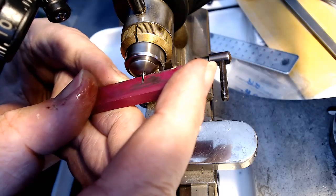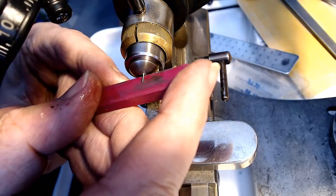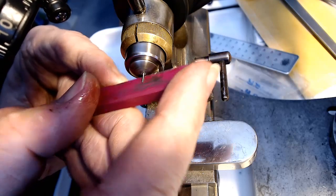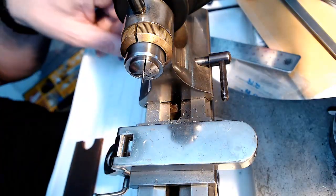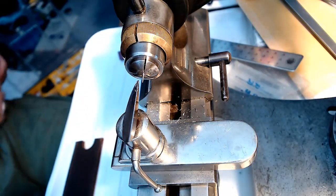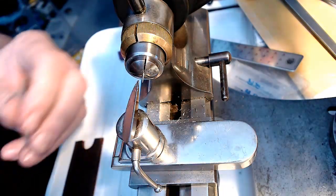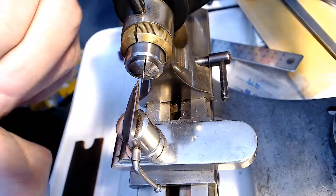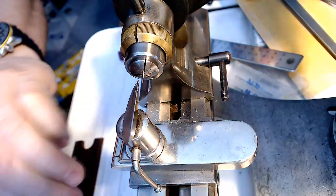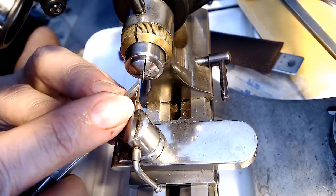And that's much less dangerous than graving it down, although I could probably take some of the material off on the fat side with the graver, and then use the stone after. So you go back to plan A, and then maybe pull out, I think this one here was the sharpest one, and I put that in here, and then see if I can remove a bit of material here. Got a lot of crap piling up here, but just a little bit more material, so I can get down to the stone after.